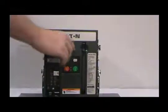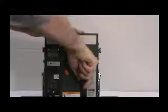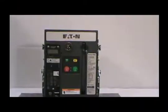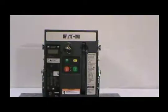In this section, we will perform a functional test. To begin, press the red button down while rotating the key counter-clockwise. Next, remove the key and charge the breaker. Once the breaker is charged, try to push the green push-to-close button — the breaker should not close. Next, insert the key and rotate it 90 degrees clockwise. Press the green button again; this time, it should work.